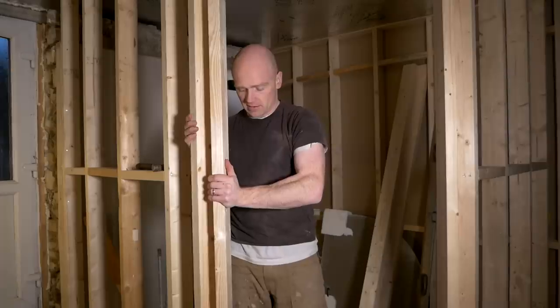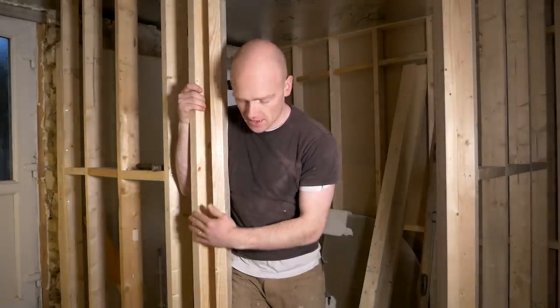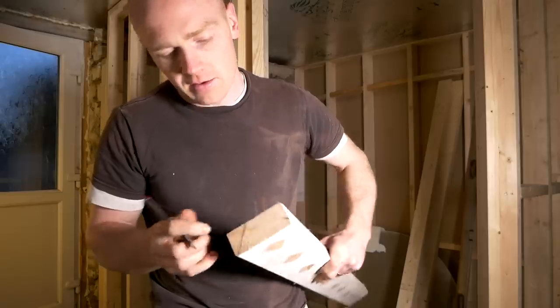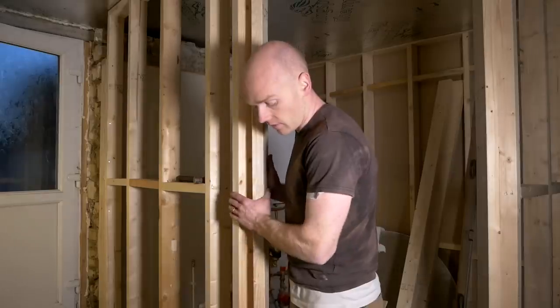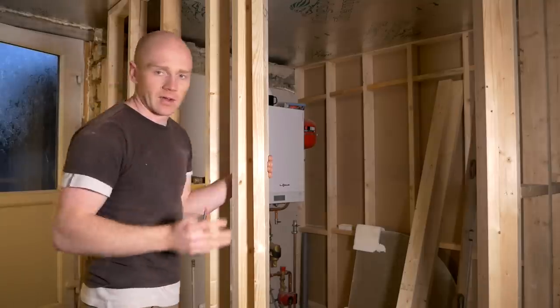And whilst I was having a little coffee just now, I did a Google, a YouTube, and in amongst the YouTubes was a chap who was doing exactly this, done the same as what I've done here. But the way he cut that, although he did it on a circular saw and I'll probably do it on the table saw, I'm sure I'll feature it in the next video, but if you imagine cutting a 45 degree triangle off the end there, like that, and then what you do is you move this section up to here, and basically ends up giving you a kite shape. It will give us the exact kite that we need to fillet that and bring us out to a point exactly what we want for the plasterboard. But that will be for a future video.